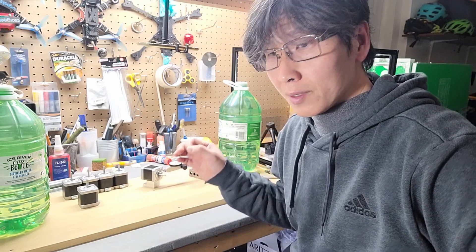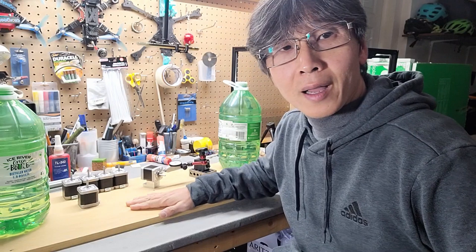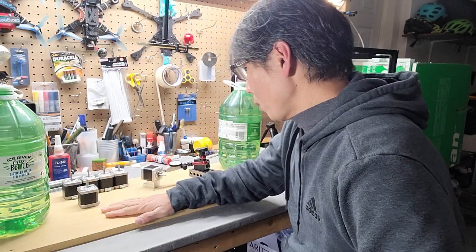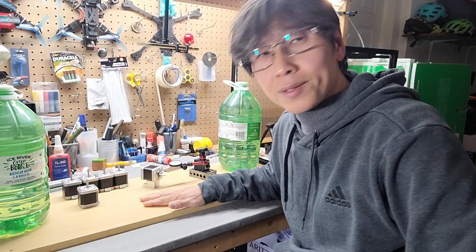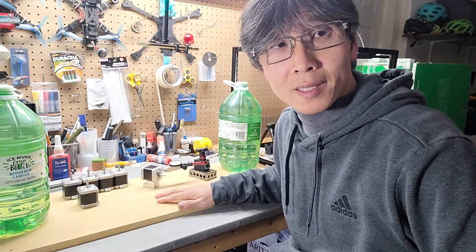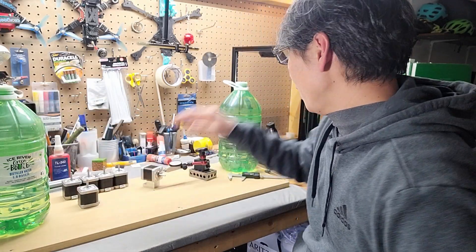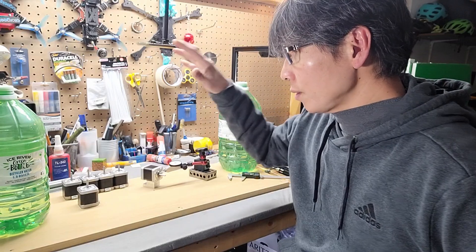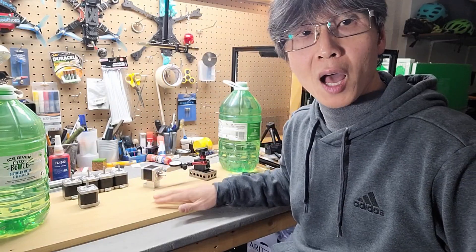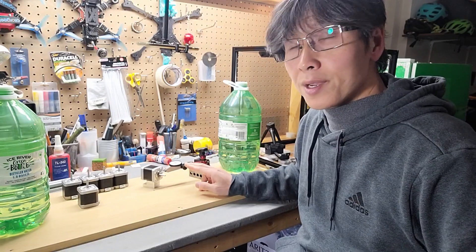I just want to see the mechanical soundness of these stepper motors. At the back here is a wooden plank — it serves as a surface plate, that's what I have in my garage. I used a four-liter water jug to weigh it down so it doesn't move around, and I have a dial test indicator to check for the TIR of the motors.